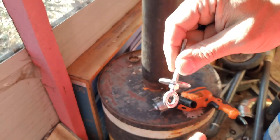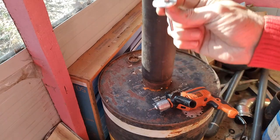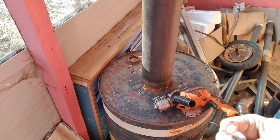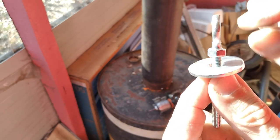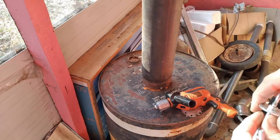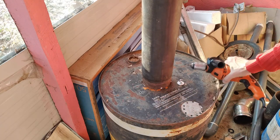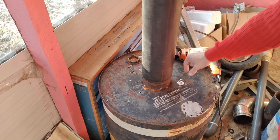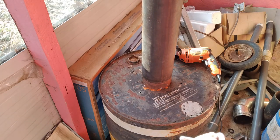I was going to show you how I'm going to hold these bolts in place. Keep in mind the tube is upside down at the moment — when it's in its proper position this will be the other way around. I've put a nut there just to give it a little bit of distance from the drum. There's going to be one of these washers on the inside of the drum — that's what it would look like with the chain coming off here on the inside.